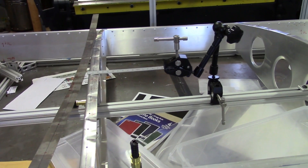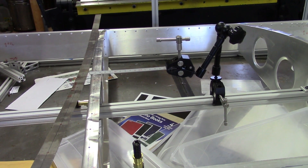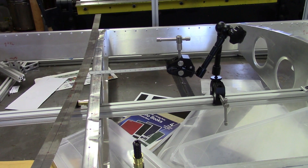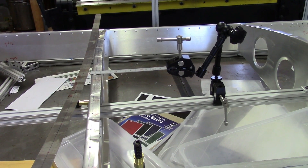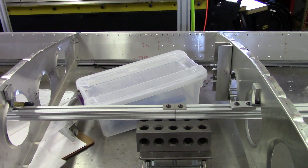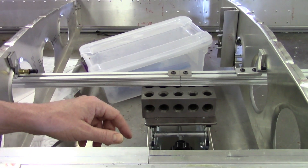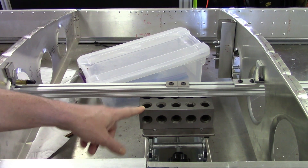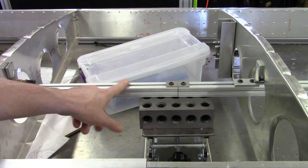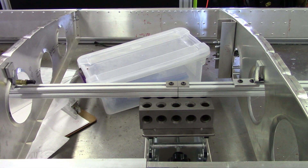As far as the other parts of the construction, since this is a 12-foot long wing, it took two pieces of 6-foot long 8020. Then of course you have to have one end anchored, and on the other end it could hang freely. The only other thing I'd mention is these lab jacks come in handy for being able to fine tune the position. In this case I had a lab jack plus a 246 block underneath, and I was able to get this level both in the center and on the ends.